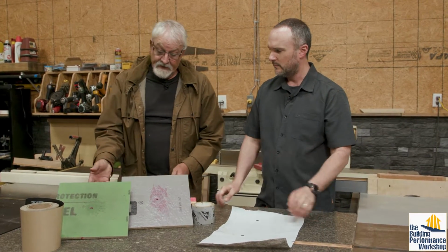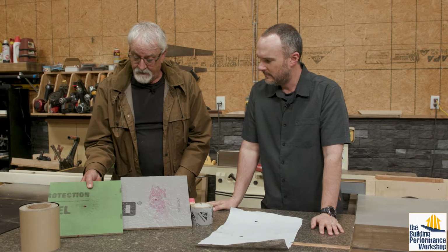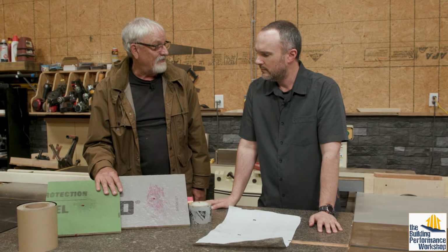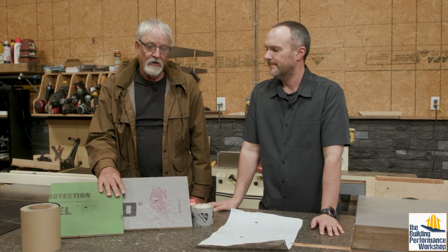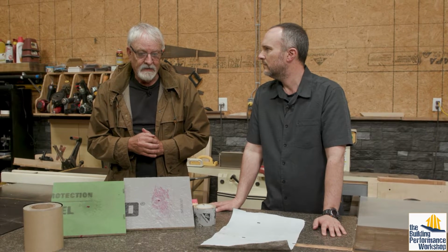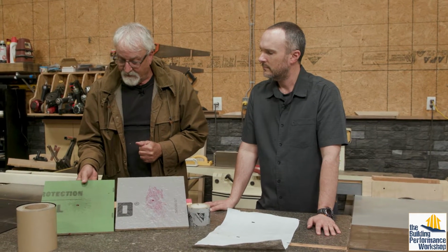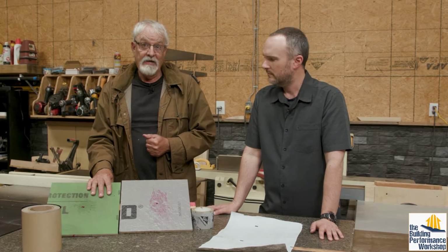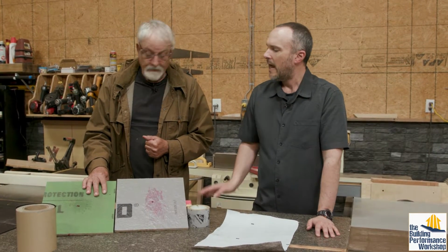Okay, so the pro of this is that when you're building a house, you install this and you tape the seams, you don't have to install Housewrap. So as a step in building, it could save you a little bit of money because it's much faster to do. So that's a good pro of it. Another good pro that we've come to learn over time is it's a great air barrier. And air barriers are a good thing when you build houses.